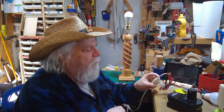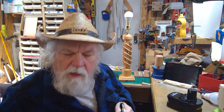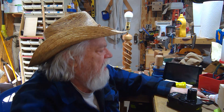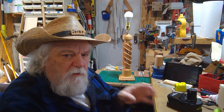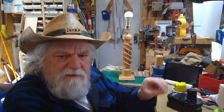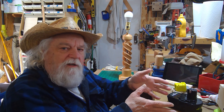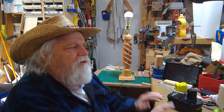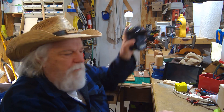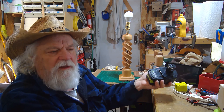If you're going to do this on a regular basis, you want to make some kind of connector that has the receptacle. Knowing what we know, this is the setup for what I want to do next — and I want to know what you guys think. We're going to make a nice wood box. I love making boxes. On the outside I'm going to have a 110-volt plug-in — maybe two, a duplex type — so I can plug two lights into it to get a little more light. I'll put a Ryobi receptacle in there, so I can take my Ryobi battery, plug it in, plug the lamp into the other outlet, and I have power from battery to lamp. A quick, easy way — no tools needed.